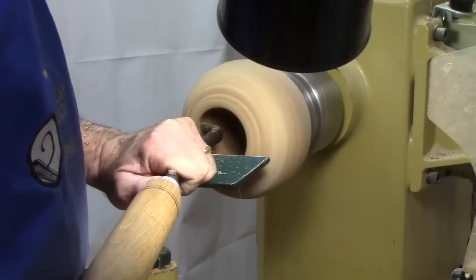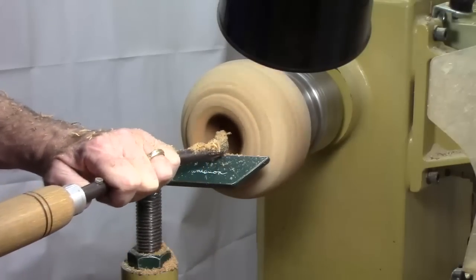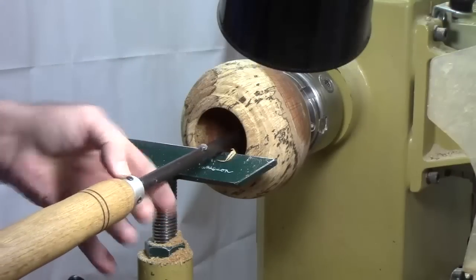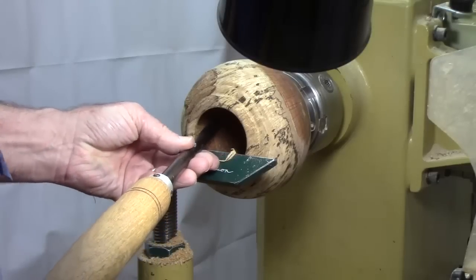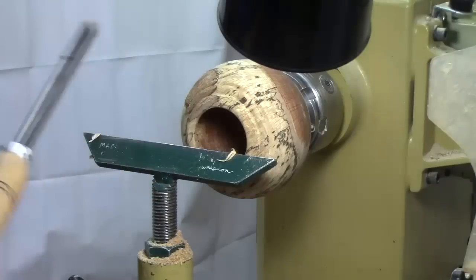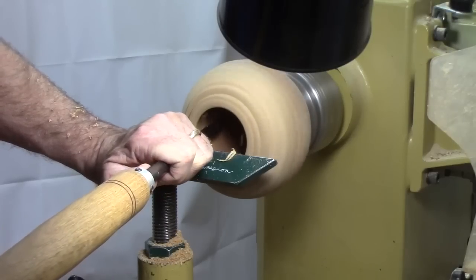I'm using my left hand to flex a little bit. I've got to be careful backing out of here not to snatch that cutter on the rim of the bowl. I had to go find my magnet to check the orientation again, but in this case I have a set screw — you can see that set screw. So I'm going to pick up the cut here and set the depth right there, and that's as deep as I need to be.